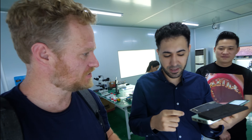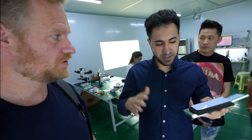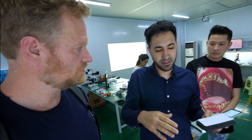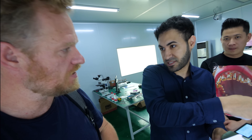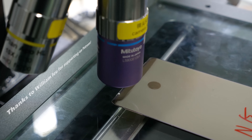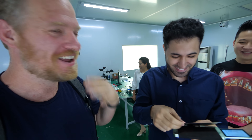This is not the bonded part — it's actually the OLED itself that had the problem. OLEDs are made from big sheets, even bigger than television size. They use a laser to cut the glass — it's automatic at the factory. But they're actually drawing traces like this in the OLED substrate with the laser too. So this repair laser is really just replicating what they do when they first make the OLED — just retracing. It's so smart.